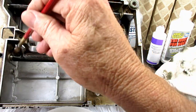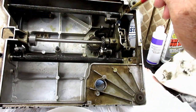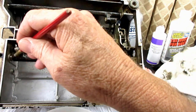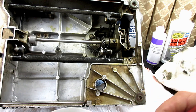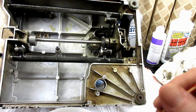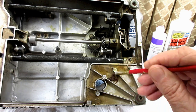For a lot of the vintage machines of the type that I do, the top worm gear area and these bottom steel gear areas have been the worst, like the dirtiest that I've encountered. So I'm tending to use a pretty strong solution here, and I'll pre-treat it on the bench, soak it like this, scrub it, and then before I take the machine into the shower.